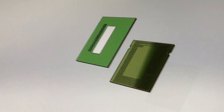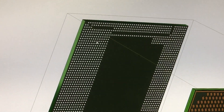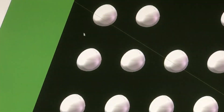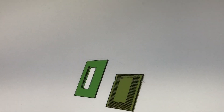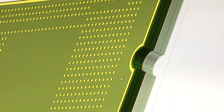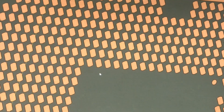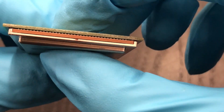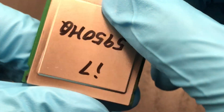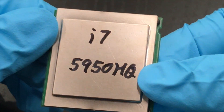More specifically, the 4th and 5th generation HQ series mobile CPUs initially have 1364 protruding pins, while the desktop CPU only has 1150 pads on the bottom side of the processor. As a brilliant solution, an additional PCB piece is added to convert this difference physically. Exactly — the mobile CPU has to have each and every pin redefined, then packaged as a complete desktop CPU.